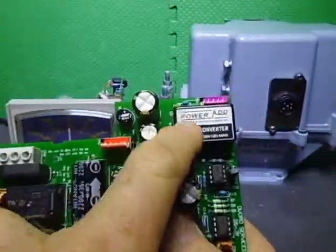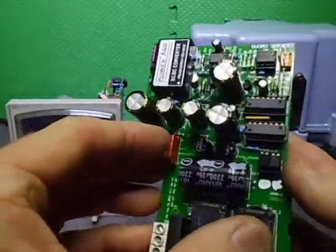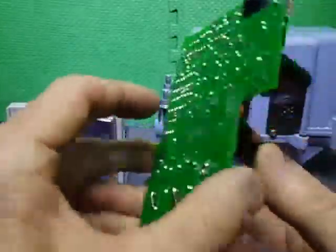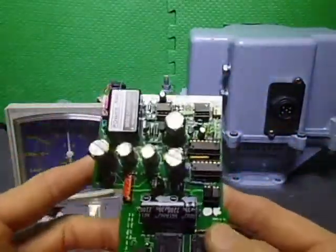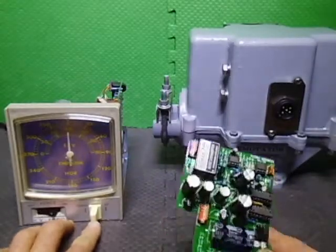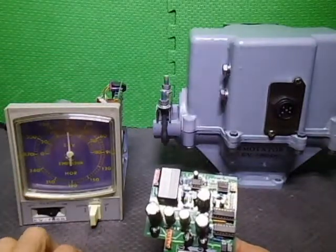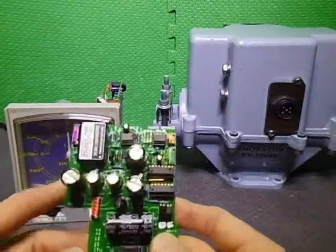I also have the power supply, the DC-DC converter for the LEDs on board. And so this was all redesigned by a company that does my PCBs. And we had to do a few little minor mods after the fact, but that's okay. That's going to be put on the later next one, the next version. So that's what the board looks like. RS232 out and remote. And there's no main power, no main current going through the direction switch, because it uses the same way that the 747 did. It uses the 5 volt supply that is for the RS232. So instead of it switching and then playing around with that, the original one was just broken into the line of the RS232, and it was easy done.